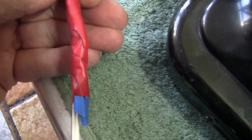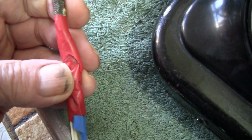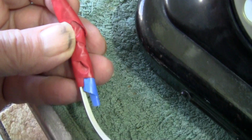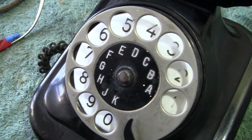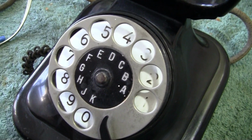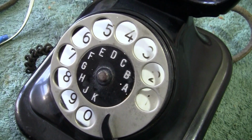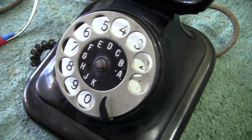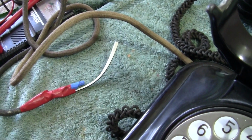An old dodge was to extend it out on a couple of easy to terminate wires. So presumably it either ended in little spades, which I doubt. It probably just ended up as bare Litz type wire. When I say Litz type wire, it's the wire that you normally find on telephones. It's that very thin stranded stuff which is wrapped around a silk or thread to give you plenty of movement and very little fatigue, and that is why they do it. But they say they're a hell of a job to solder. So that's what I think I've probably done there.